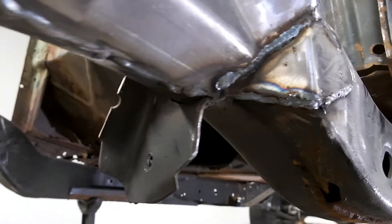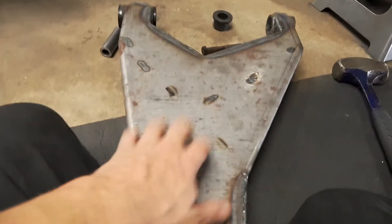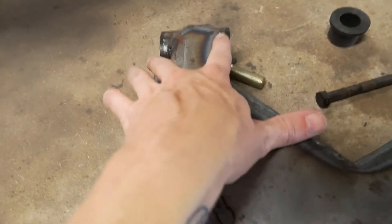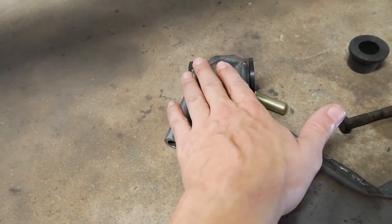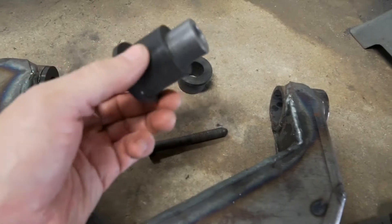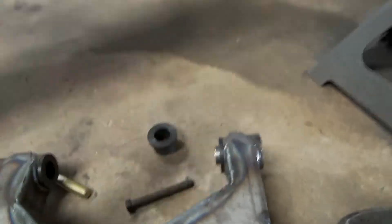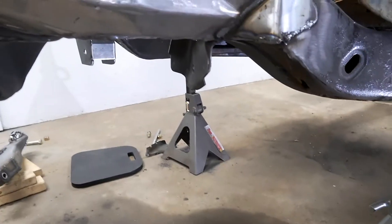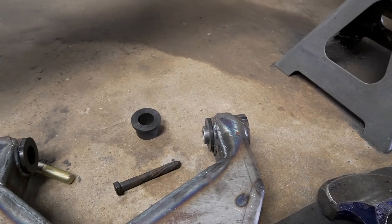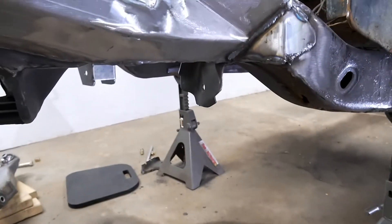Here's what we've got going on — I cut off the front side of this bracket. I'm leaving the backside on just so I can get this hole aligned and the control arm sitting in the right spot. I have both of the bushings installed on the front side. On the backside, I'm going to use this bushing with the sleeve in it, because if it sticks out on this side at all it won't fit in there with the bracket. I'm just going to use that to make a template to be able to bolt that in.